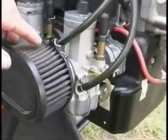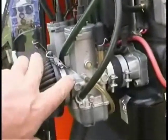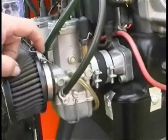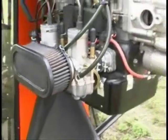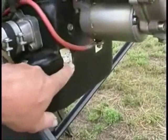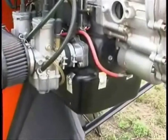This is the style of air filter that you want to use, and this is the way that it's clamped. You can see that if the air filter comes off, the clamp is still under the propeller. So what you want to do is run the safety wire underneath the clamp. It prevents the air filter clamp from entering the prop. You can see that this individual has also used duct tape to prevent the bolts from the cowl from entering the exhaust system.